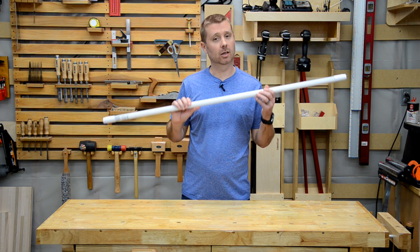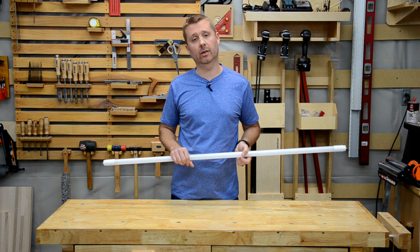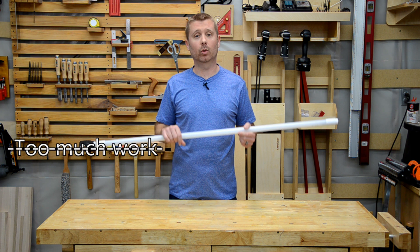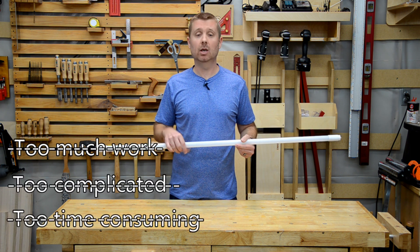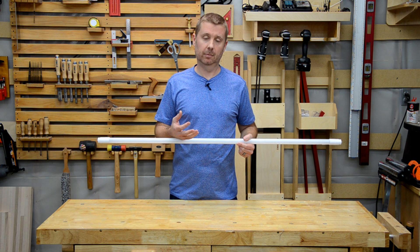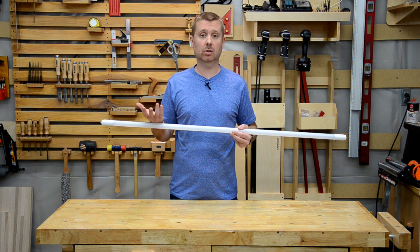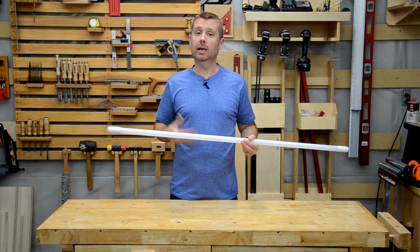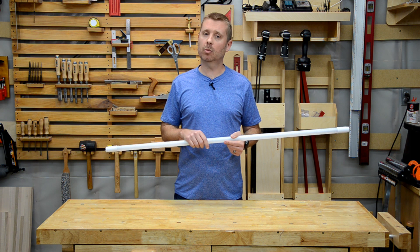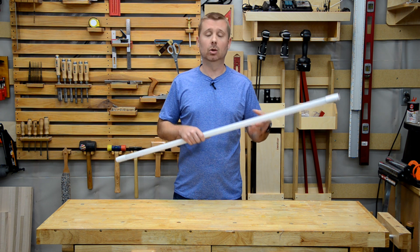With these tubes it's entirely up to you. Let's go over how this tube works and why this is the one-size-fits-all LED retrofit tube. This is a Type A plus Type B. Type A means it will work with a ballast — also called plug-and-play tubes. You take out your fluorescent tube, put this one in, it just works. Type B means you have to bypass the ballast. Put the two together and you have options. You can take out fluorescent, put this one in, and if the ballast ever fails you can bypass it, put this right back in, and it will just work. One caveat with Type A is they're not always compatible with every single ballast. Most come with a compatibility chart, so you may want to look at your ballast model number and see if it is compatible with the tube that you choose.